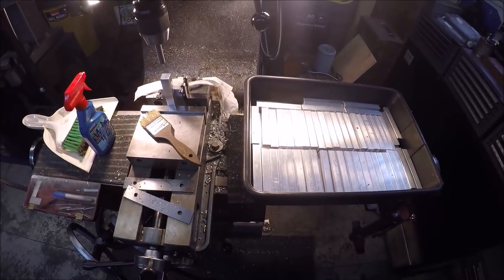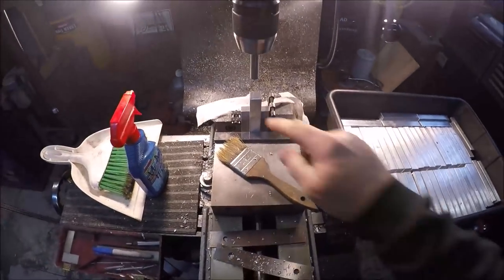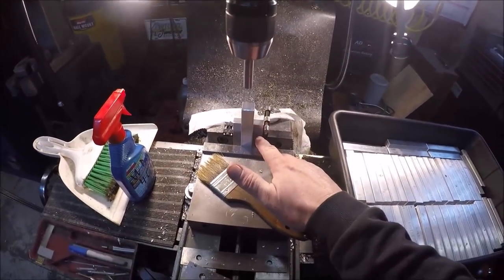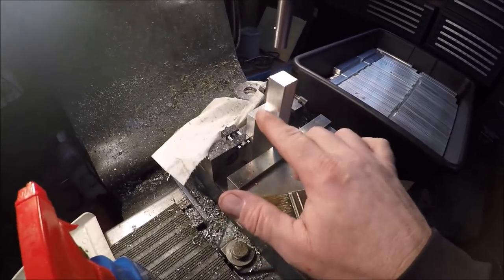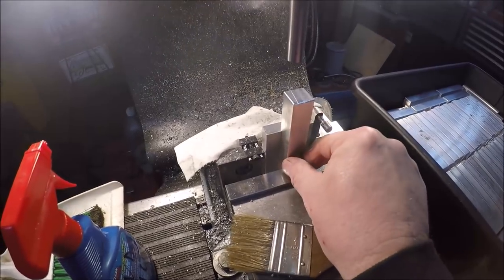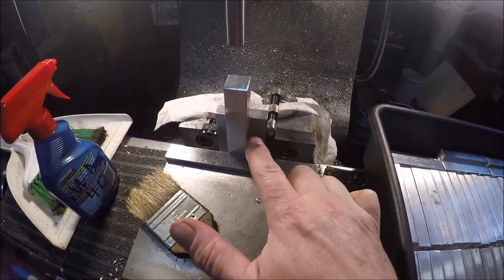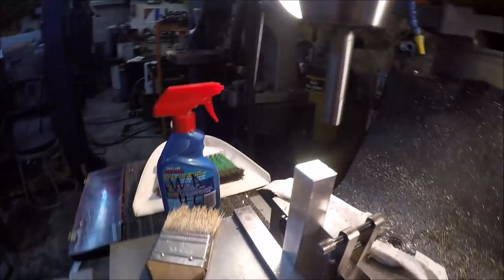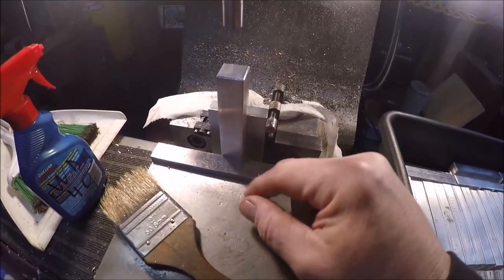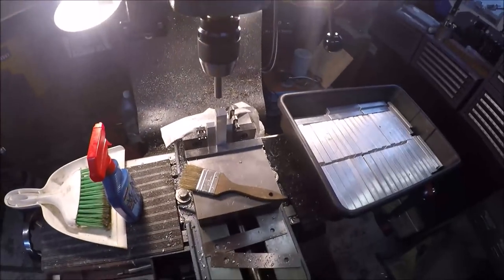I figured I'd show you guys the production run I'm getting ready to do. These are the C-clamps that I make for this customer. I got all the stock cut and I'm getting ready to drill a hole down in them. So I figured I'd show you the little jig I made to make my life easier. It's just a piece of 6061 and all I did was mill a three-quarter slot down it, so it holds this thing perfectly upright. I've got a stop and a machinist clamp to keep it straight up and down, and I milled a lip on it so it sits down on the top of the jaw. There's also a magnet in it so it sits straight up, then I can just plop one in, drill a hole, take it out, and do a production run.